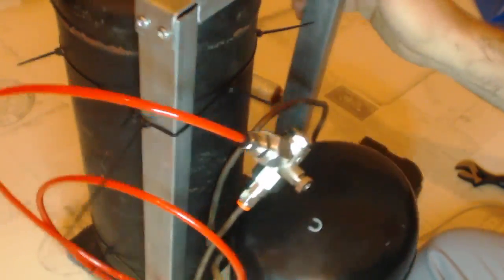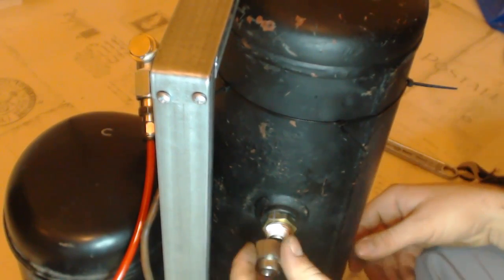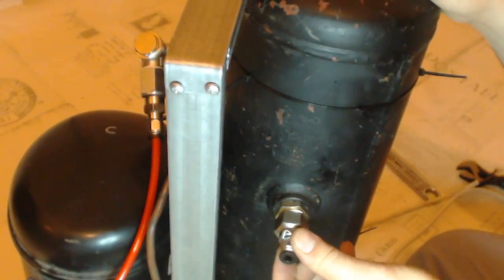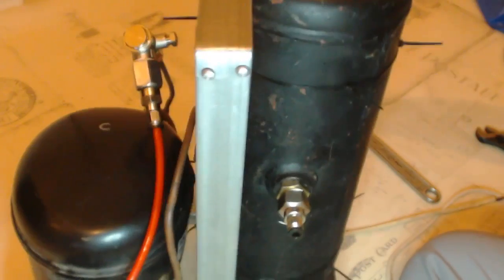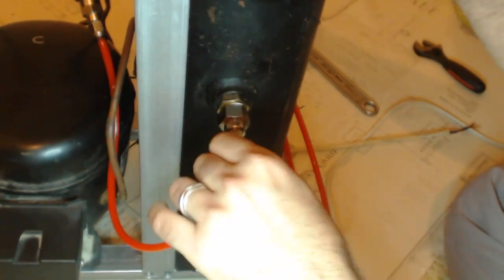And because I know you are going to ask, I use so many different fittings and connectors because these are what I had in my toolbox. As I already told you before, there is no point in telling you what exact fitting or connector I used because every local store sells what it has. But if I can recommend something, it is to prefer connectors in inch and not in metric. The metric ones are made mainly for trucks and professional uses. For this reason they are overpriced. As you may already understand, you begin with the thread that the air tank has, and then you buy similar fittings and connectors to connect the other parts together.